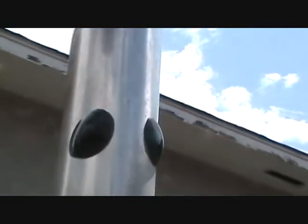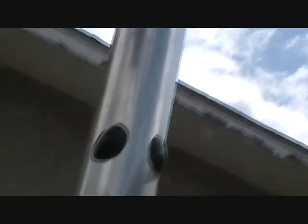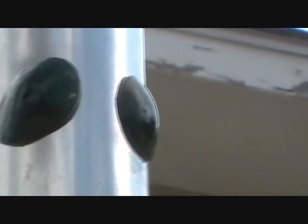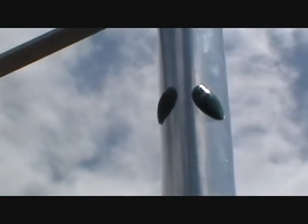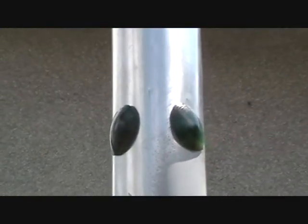These are the little vortex inducers mounted on the wings. As you can see, I got some of them to form pretty close to the shape of the wing as it comes around the leading edge. I'm sure they're producing a certain amount of drag associated with shoddy workmanship, but I did the best I could in those circumstances.